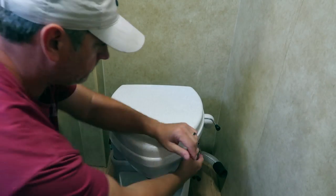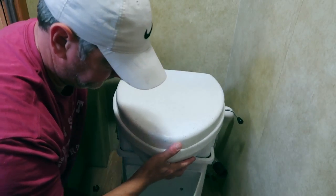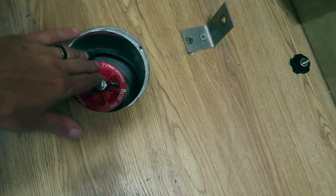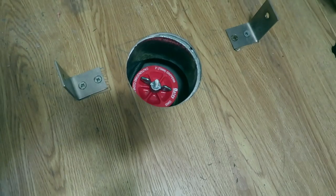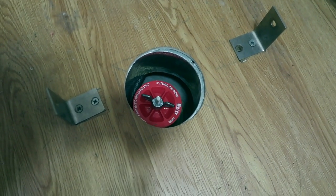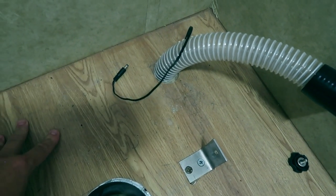With the sides latched up, the toilet is free and comes right out. I talked earlier about the existing sewage connection that I left in place — this goes right into the black tank. This is where the original toilet flange was attached, with a pipe coming out and a wax seal, just like a typical house toilet. There's a test plug that I put in, and if the next owner wants to put in a traditional toilet they can, since I left everything in place — they'd just have to run the water line back up.